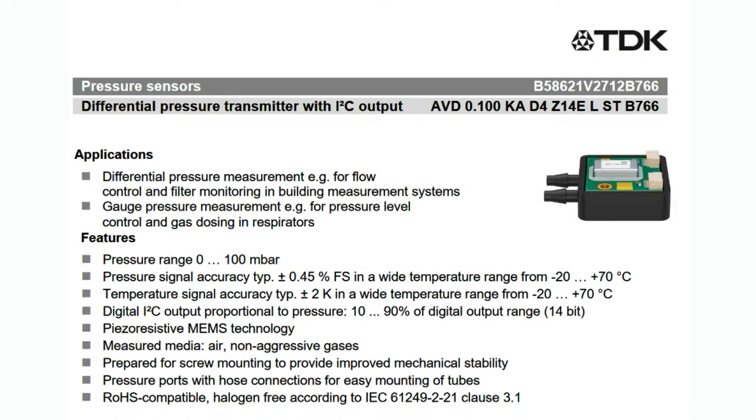But the filter gets clogged up with dirt and dust, and then the HVAC has to work harder and harder and harder to push air through the filter. And you're supposed to check your filter every 6 months, and, yeah, sure. But one, you could forget. Or second, maybe you have a building that's so large that it's hard to check the filters all the time.